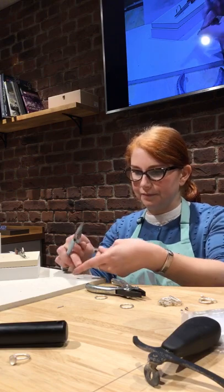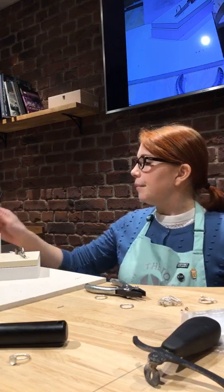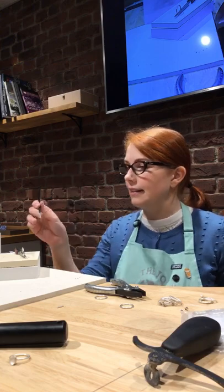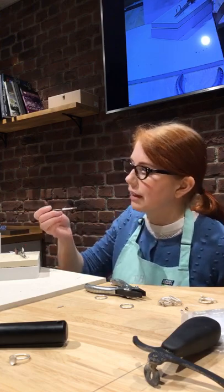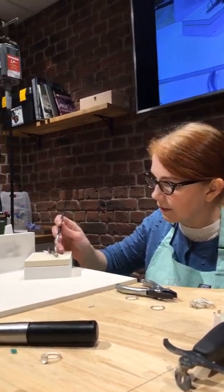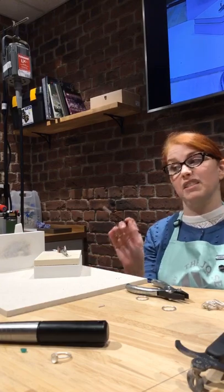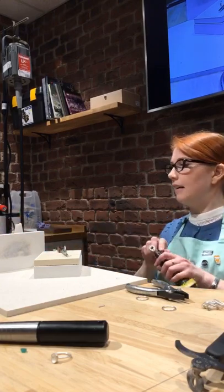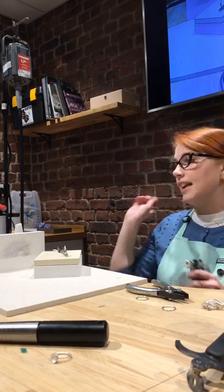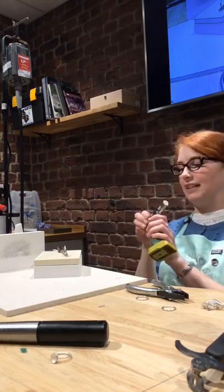There we go. Okay, so, solder pallions. Pick it up with a flux brush. That means that you put flux on your solder pallion as well, so that's clean now as well. Just dab it or stroke it to get it on. You want to position your solder pallion so that it's in the middle of that joint approximately. In general, I usually have a spare pair of tweezers in this hand just to poke and prod if I need to.